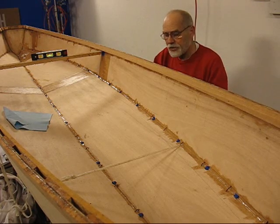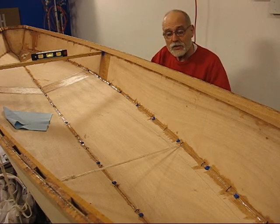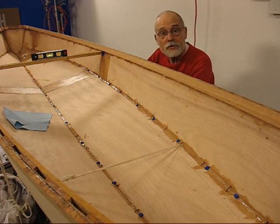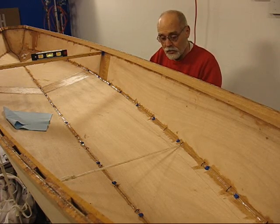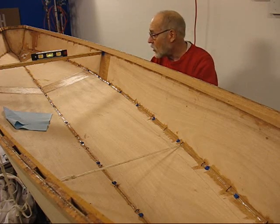Since there were pretty good-sized gaps on the outside, I took the nozzle while I had it and jump stitched on the outside — about every foot or so, giving it like a three or four inch little fillet on the outside. Then just use your gloved finger to smooth it out and smooth it into the opening.